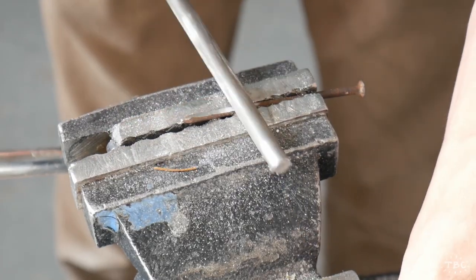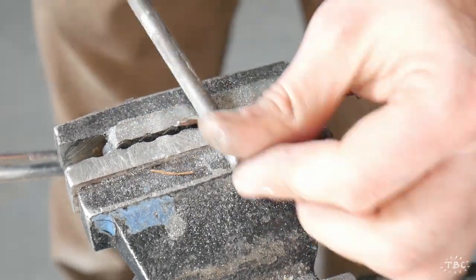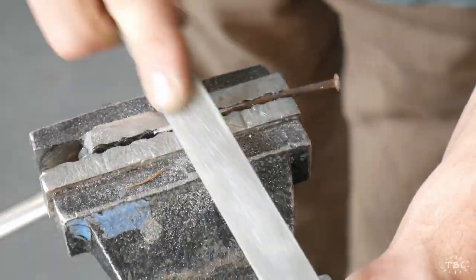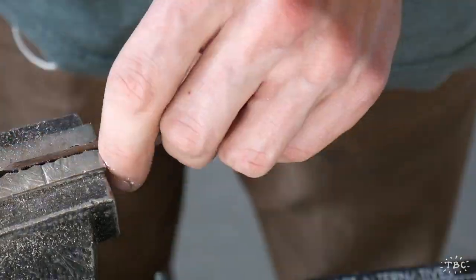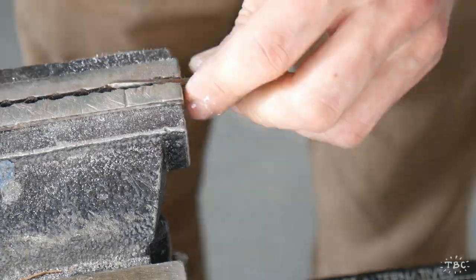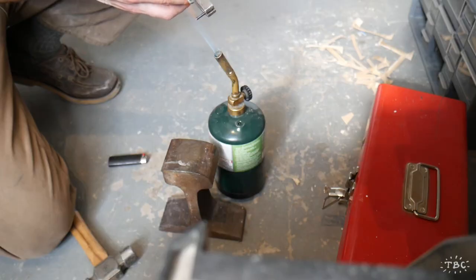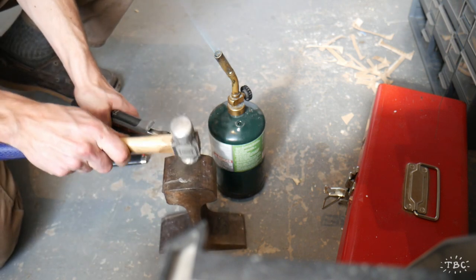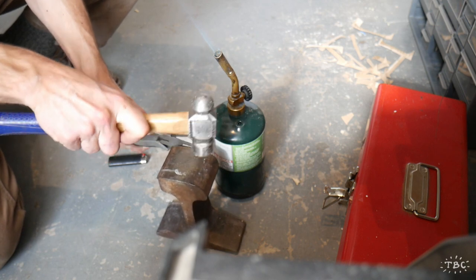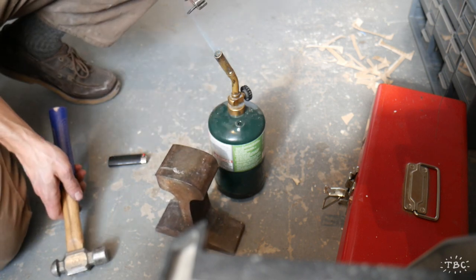You can see I'm drilling the holes with my pin drill - this is a really fun tool that works really well for drilling these really small, precise holes. Now we're moving on to making the next piece. I did find it necessary to heat the metal for this part because I was trying to expand the base of it and be a little bit more precise with what I did expand and what I didn't.